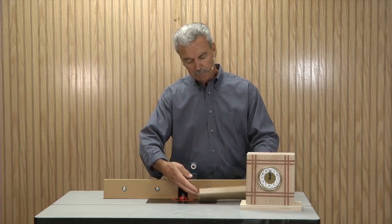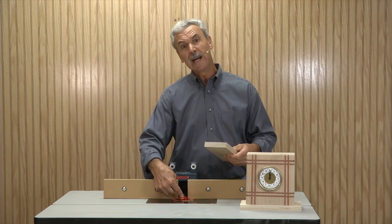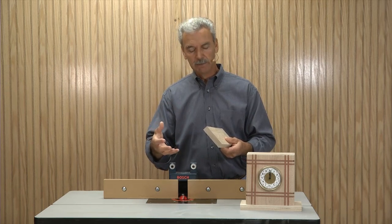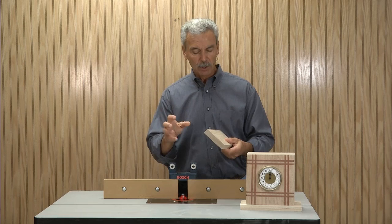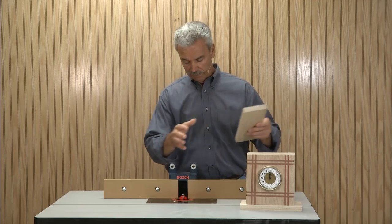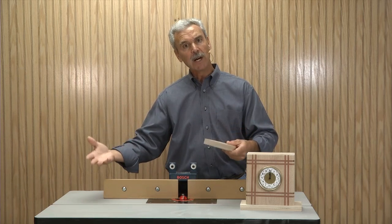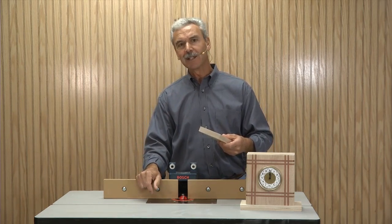The third thing is, depending upon the stock you're using and its thickness, we may have to take multiple passes with the bit. The issue is if I'm using a really dense hardwood and trying to take too aggressive a pass with a much larger bit, it's an awful lot of work and occasionally that will result in chipping. So multiple passes is always a good thing. Now that we've got a great bit and settled the issues with bit speed and router passes, let's go in and route this piece and let me show you what the finished edge looks like.